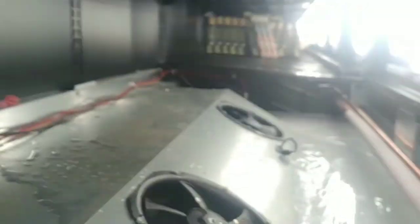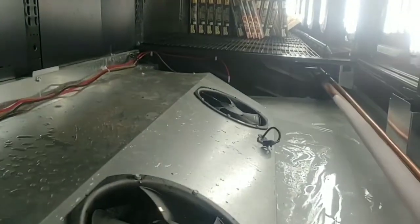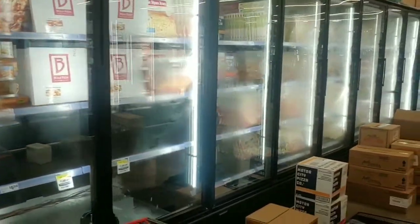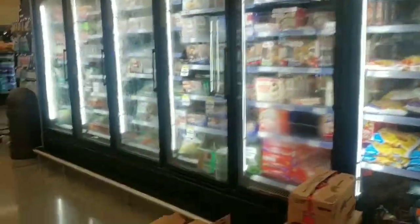These freezers are coming back on — the whole row went into defrost with the computer. I'm gonna go force them all back into defrost, otherwise it'll get even colder in here. You can get away with that as long as you don't have it out of defrost for too long, otherwise everything will start to melt. But everything's pretty cold right now, so let's go to the computer and force it again.